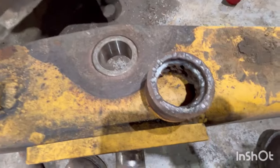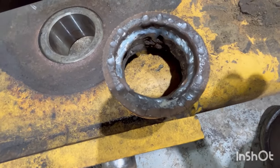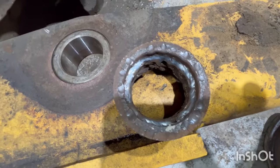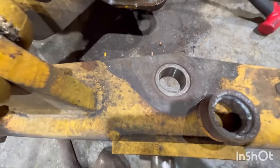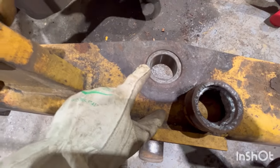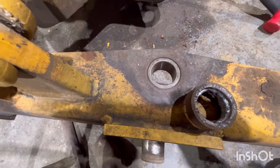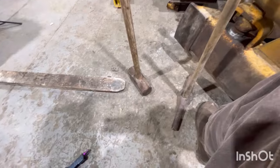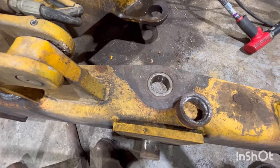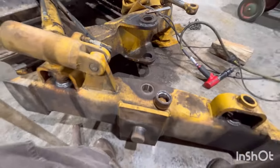Here's what I did - just ran a whole bunch of passes around the inside of that old bushing. What that does is when it cools down, it makes that bushing contract. It dropped down a little ways further, but I actually used the new bushing to drive it out just with the 16-pound sledge. So one down, two more to go.